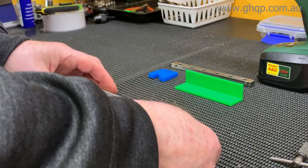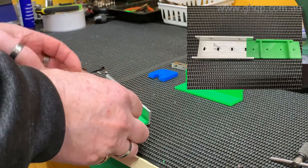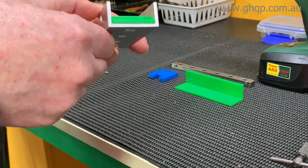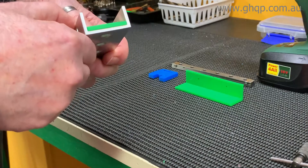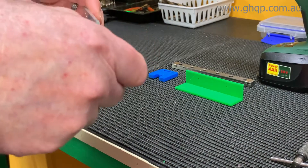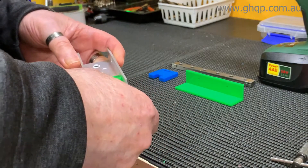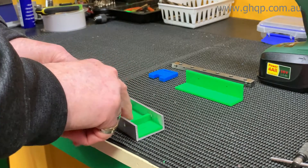The way you would do that is you would insert it and slide it into the channel. I do accept the fact that this is the aluminium U-channel that I purchased locally — in other countries and with other manufacturers of this same dimension, these may vary just slightly. So it may be that when you print this out it could be a little sloppy or even more tight. You may have to sand it off a little bit so that it fits in, or if it fits in too loosely you may just have to put a couple of little bits of paper in there just to space it out.